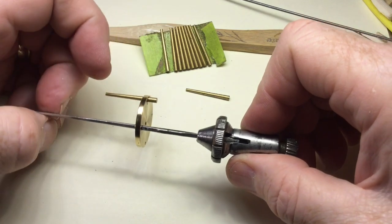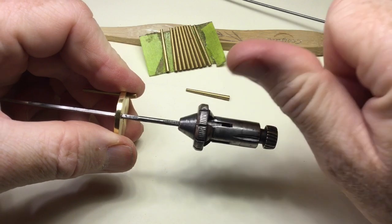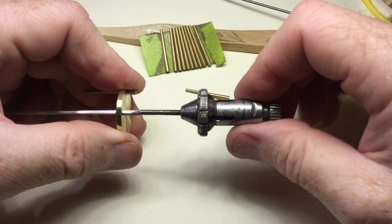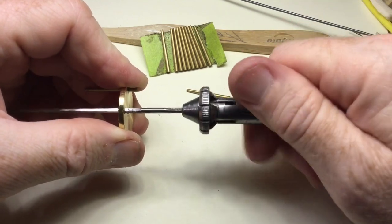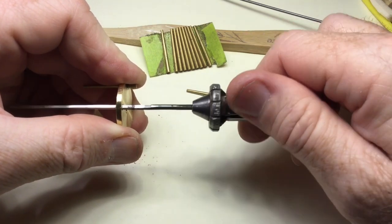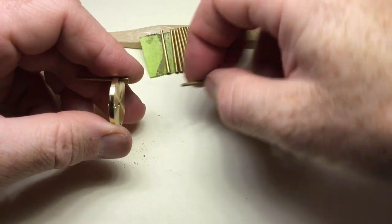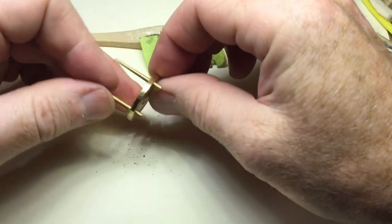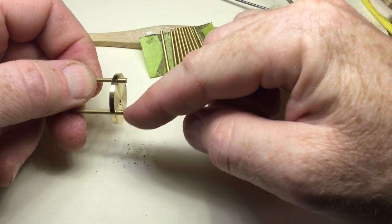As I have very slightly gone askew, I'm going to apply a little pressure in the correction direction while I turn the broach. We've gone pretty much to the end of the black marks on the broach — my depth guide. Slip that in. That's now pretty close. In fact, it may have actually gone just a smidge further than the previous one.